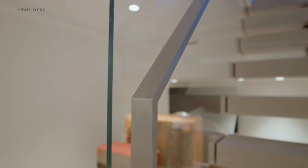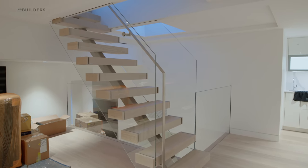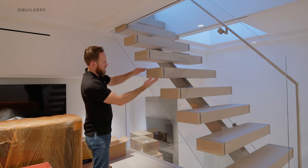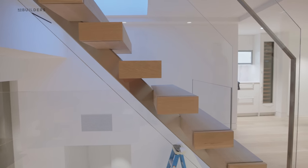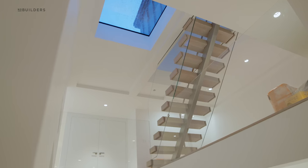Handrails — now that they're uncovered — made by Rich Costa. Stainless. Same thing with the mono stringer. We've talked about this mono stringer a handful of times, but I just want to really call attention to the detail now that all the protection is taken off. These treads are designed to look like they're just resting on the mono stringer with no stanchion underneath them. We did that by installing a flat plate inside the center of that. If you want to see that, there's another video — Doug, you can tag that in the video here. That detail along with these end caps that are all grain matched, so that grain runs continuous all the way through. You can see how that grain runs right through the glass.